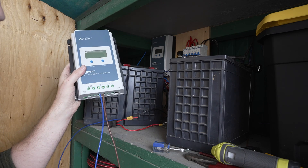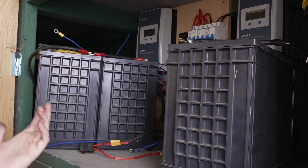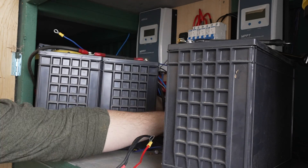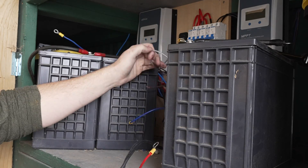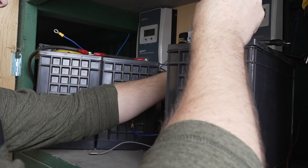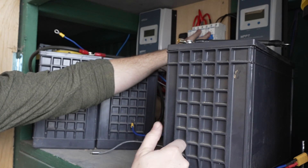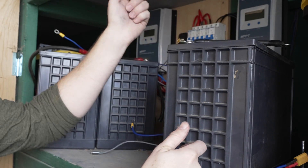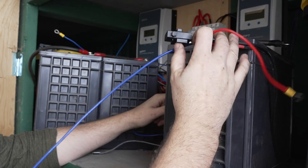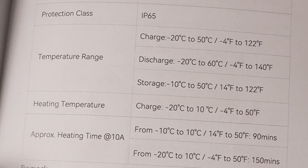One thing to note: you usually have to hook these up to the batteries before you can hook them up to the solar panels. Solar may seem a little intimidating but it's actually relatively easy — very simple hookups to build yourself a sweet little system. The nice thing about this is that during an extended power outage it would be recharging itself as it's being used, keeping your tank going for a lot longer. Don't be intimidated by solar — it's really only a couple of wires to hook up. I've added breakers and disconnects, though they're not necessarily required. You would want a fuse on your load just in case a wire is ever touched or shorted — pop the fuse and you're protected. This is the fuse I have in line going toward the vortex.